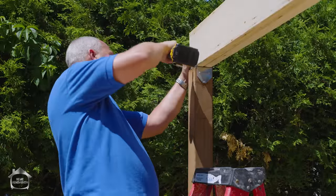I'm going to explain my change of plan. I have two beams — one's pressure treated on the outside. Because I'm definitely going with the metal roof now, I want to keep the pressure-treated beam on the outside. There's a possibility that the metal roof where it joins with my one-by-six might have a seal issue, so I want pressure-treated on the outside in case any water gets there. I'm also going flush on the front and extending out a couple of inches on the back for a little protection for the door hardware.